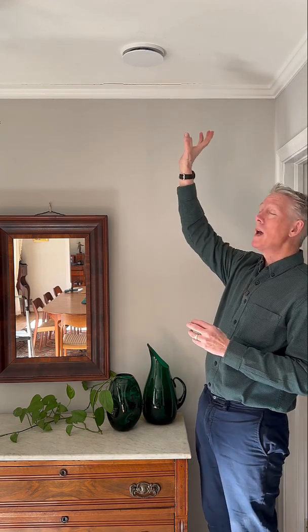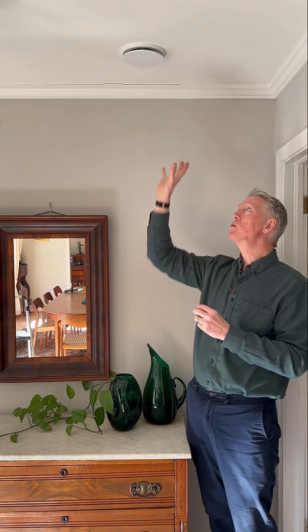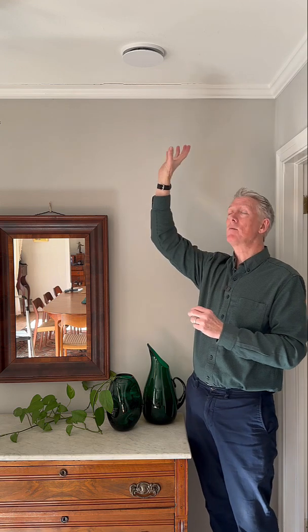This is my house, and we have a ventilation system now. Houses need to be as airtight as possible. No, a house does not need to breathe — that's the title of my book. We want outdoor air coming in through controlled means, with a ventilation system that will bring outdoor air in and distribute it throughout the house. That's what we have right here.